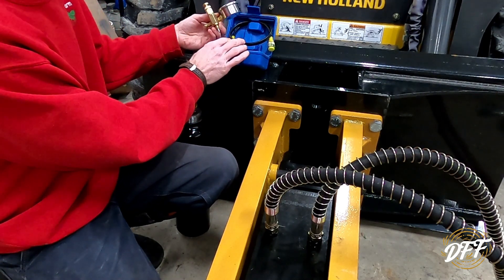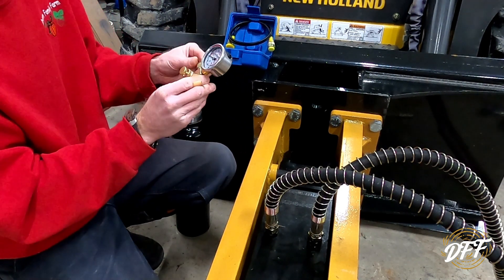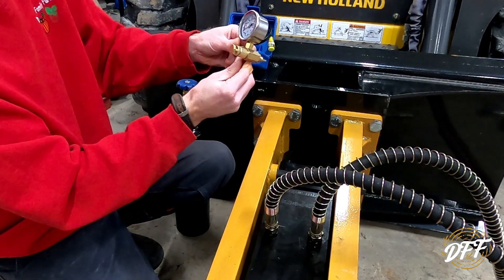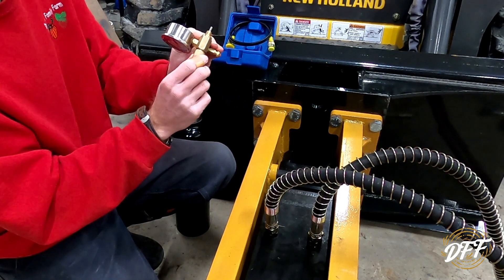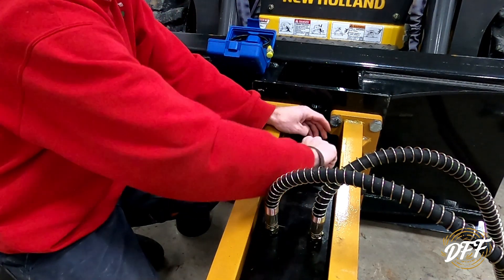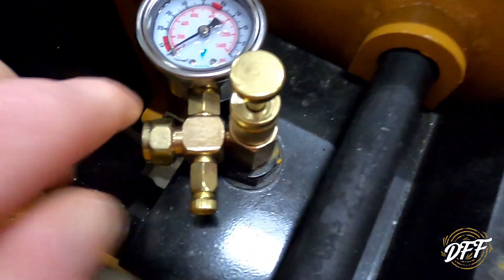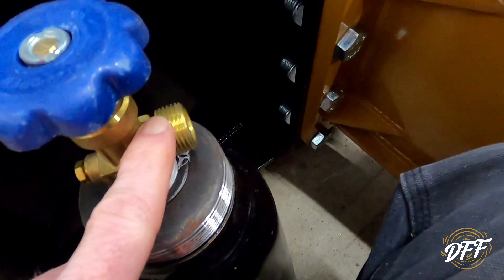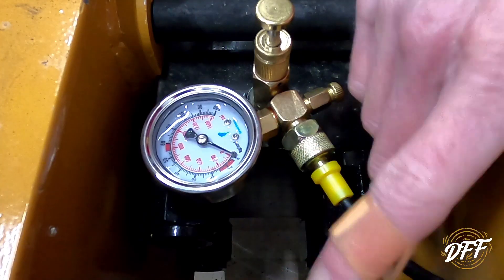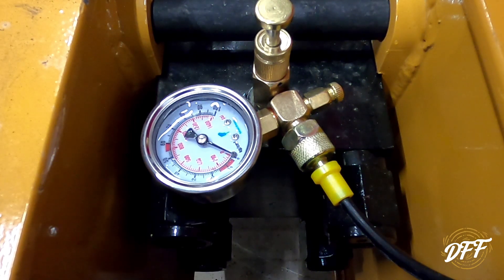I'm assuming there isn't any nitrogen in this unit. That plug has a little O-ring on it — don't lose that. Let's figure out how to do this. Make sure that valve's closed, make sure that one's closed — and then this guy here, that's how you screw it in. We'll snug that up by hand. So we've got the gauge screwed in, hook up the line to our tank, and we'll very, very lightly crack that open and watch the gauge — we don't have a regulator, so going real slow.